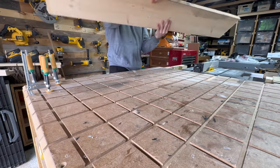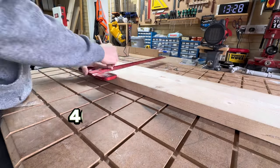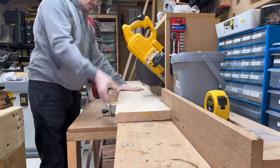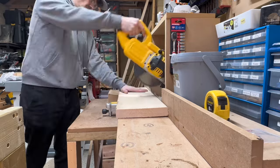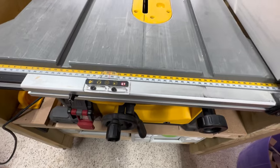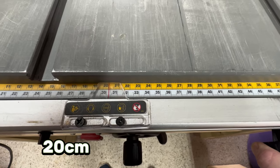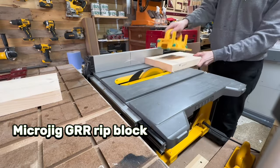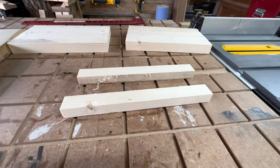So this is the scaffold board I'm going to be using. I found it on Facebook Marketplace for about £5. I'm going to mark up my board 40cm, 35cm and 35cm, and I make the cuts using the mitre saw. The 40cm is the top and the two 35s are for the legs. The width of a scaffold board is 22.5cm. I set my table saw to 20cm so I can make the legs narrower than the top — this is just personal preference. I make my cuts using the micro jig GRR-Rip block, which is great for safety, keeping your fingers from the blade. Keep the offcuts to the side because we'll be using these later.